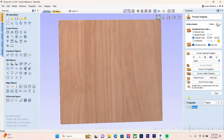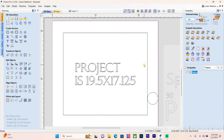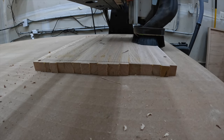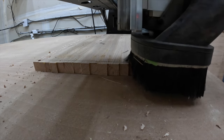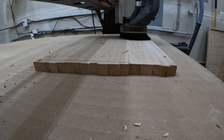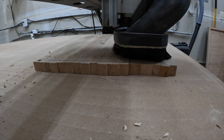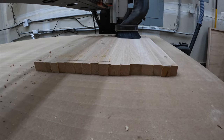In the preview, there's a little material left in the corners, but our blank is inset from that so we're fine. Once we flatten one side we flip the work and flatten the other side. I do have a planer, but flattening on the CNC ensures the material surface is coplanar with your spindle — not just coplanar with the planer cutter head — which is really important for V-carving with a lot of detail, ensuring depths are consistent.